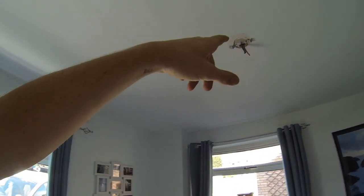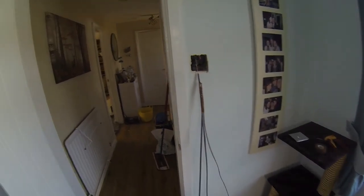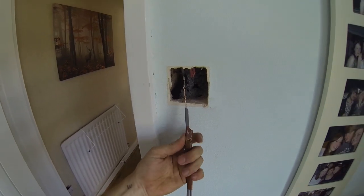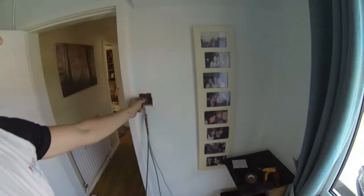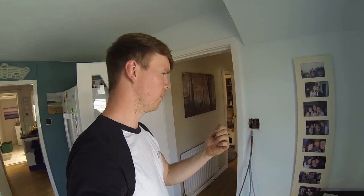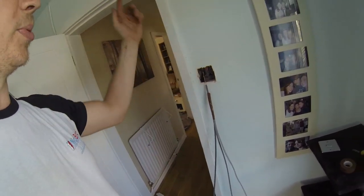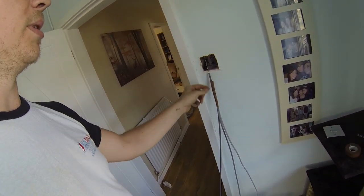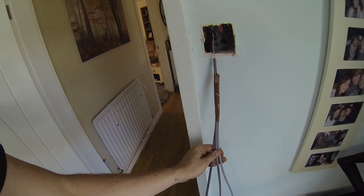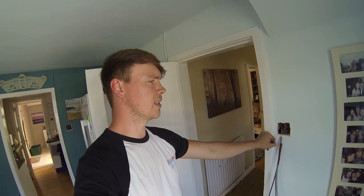A little tip I use: because I'm running three cables — loop in, loop out, and the feed to the fitting — and there's an inch-wide piece of capping in there, I strip back, twist over, make a loop, do the same with the other cables, and tie them together. Always use the live or neutral — not the earth — because pulling by the earth stretches it inside the cable or possibly snaps it. I've got two drums of 1mm cable on the van for the loop in and loop out, and I've run off a long length for the fitting with an extra metre just to be safe. I've taped them all together to try and pull all three up in one go.